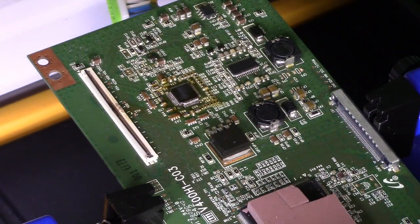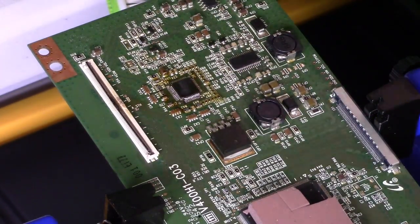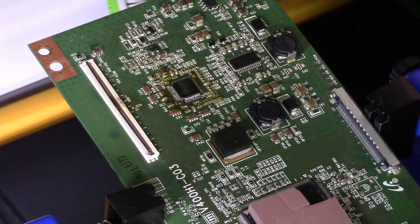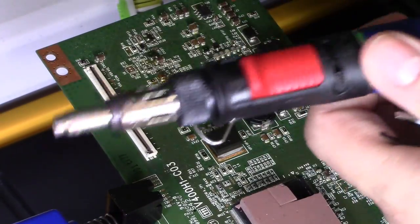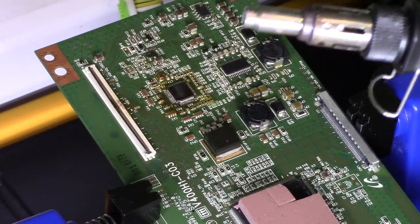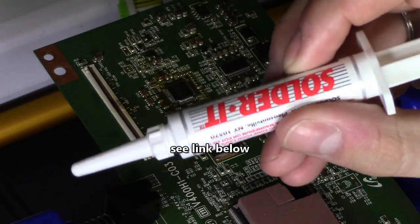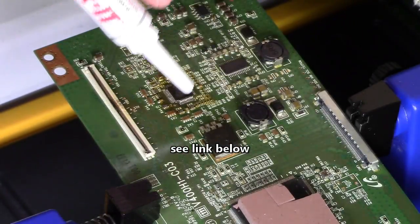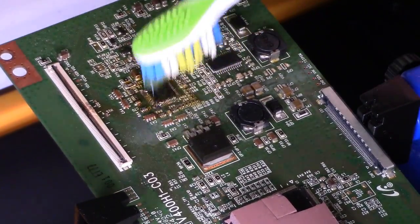I already replaced the T-con board and the TV is running, works great — but it's nice to have a backup board or to teach you guys how to switch out these ICs. So this is considered an advanced repair. I'm going to be using my iso-tip soldering iron, which has an interchangeable tip — it has a heat blower tip and a standard soldering iron tip. You just swap them out by twisting this piece off. Solder paste is really good if you're soldering an IC; you just wipe it across the legs. I'm going to use a little bit of flux on the toothbrush and wipe it on top right here.